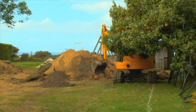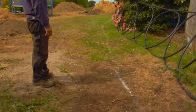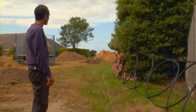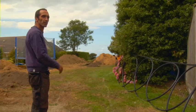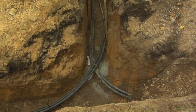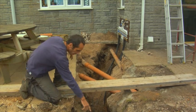Slinky ground arrays can also be installed up and downhill, and can be bent into U or L shaped trenches. With a little bit of planning you can overcome anything you might consider a problem, so long as centres aren't closer than 5 metres to the next trench. A further header trench with a width of 500 millimetres and a minimum depth of 1 metre should be dug between the slinky trenches and the manifold location to accommodate all the header pipes.